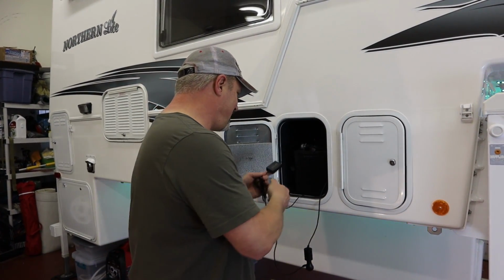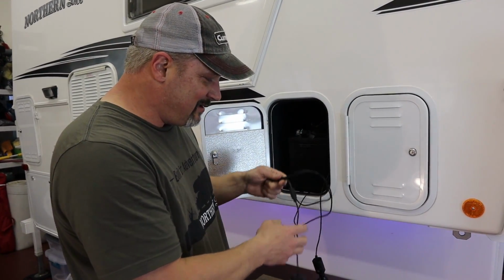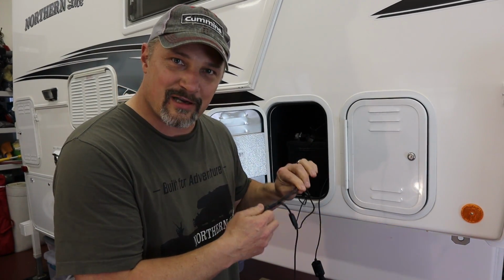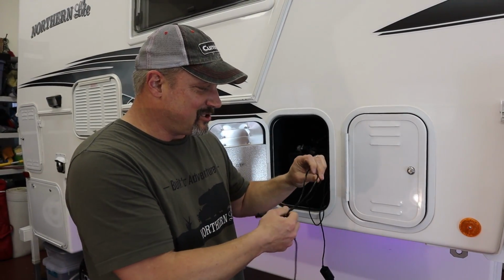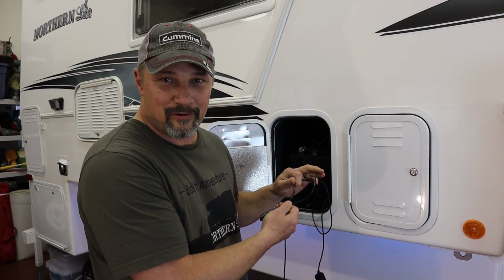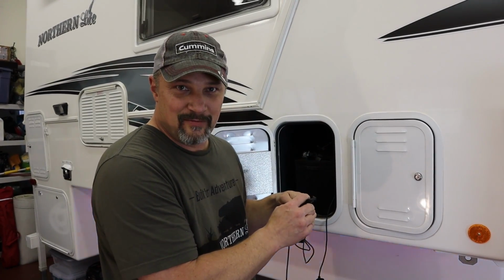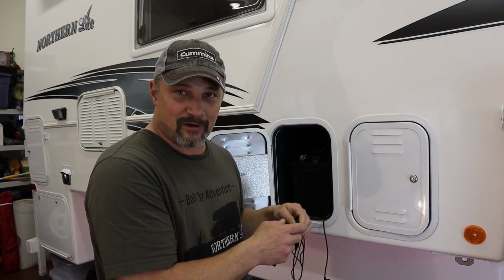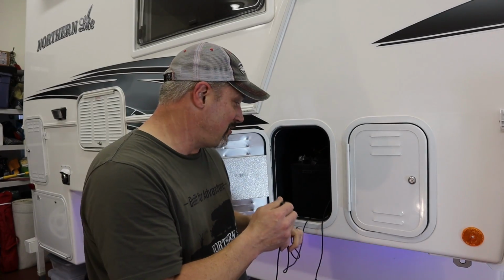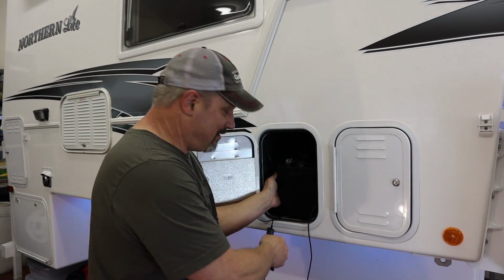One little tech tip, don't do what I did. In order to wire it and run the wires up through there, I did cut the wire, thinking that I'll just cut this wire off, slide it up through, and put a connector on it. But each of these two wires has 4 tiny little wires inside it. So try not to do that unless you have to, because I had to splice them back together, and Carla helped me solder all the ends back together, and it works fine. But it was just a lot more work. Time consuming. Yeah, it was time consuming. So don't do that unless you have to, in order to run the wires up through a tiny little hole or something like that.